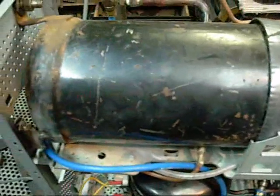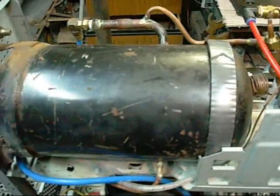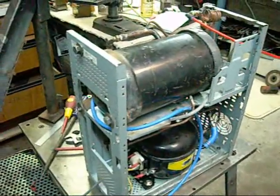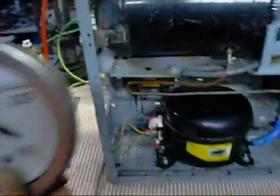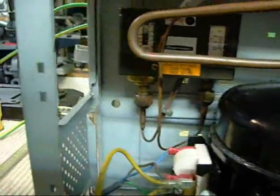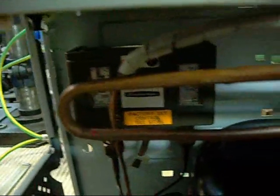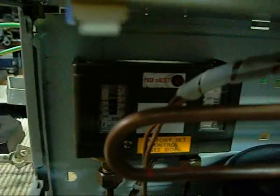A lot of it is sold as scrap metal; I just pick it up out of the steel bin at the local scrap yard. The accumulator in this thing came from an Australian-built Kirby refrigeration unit used in an IGA supermarket meat case - it's actually the same accumulator that the Kirby reciprocating compressor came from, as shown in one of my earlier videos. The pressure control switch isn't hooked up properly yet - it's tripping its overload at about 390 kPa. I've just got to tweak the little adjustments on it to make it cut the compressor out at the set pressure I want, without going into overload mode and requiring that little button press to reset it.